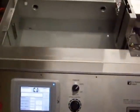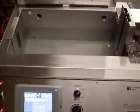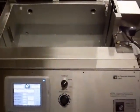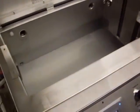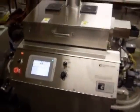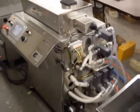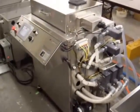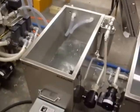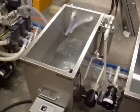We're only going to be showing the alkaline cleaning step here due to time constraints. This machine has a tumbler mechanism for parts rotation — the basket's not in, but that's the mechanism on the right-hand side, the chain drive there. Closing the cover shows the exhaust plenum, which would normally be connected to a flexible line to exhaust out of the building. We're still draining here, back into the heated storage tank.